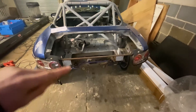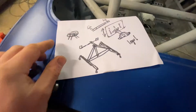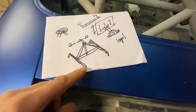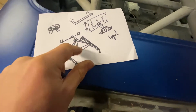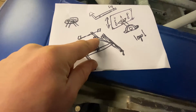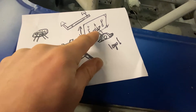A few little sketches that I've just planned out — this may change along the way somewhat. Basically I'm going to have box section running down, caster wheels, box section across the bottom, triangulate all that, shaft through the middle. Probably a little bit over-engineered, but we're going to have a top plate with a block bearing, a bit of 45mm roll cage tube.